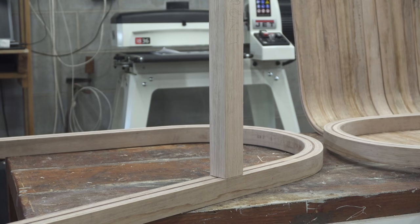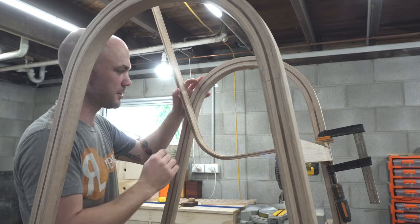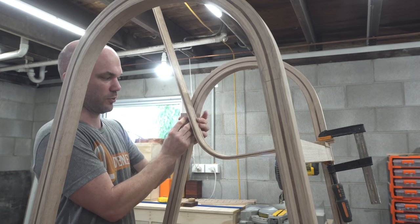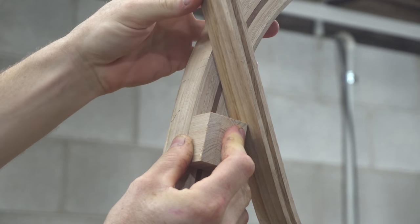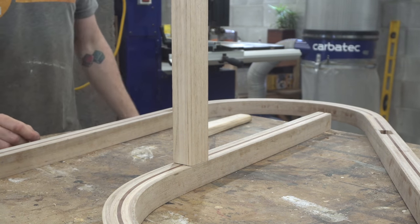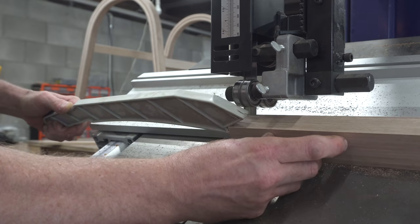I've set up the chair, and now with the front rail in place I can work out where the back rail is going to be for this slat. This curve is probably the trickiest bit about attaching the slats. My first thought was to cut an angle onto the rail and sit the slat against it, but then the tenon becomes a lot smaller and cutting the mortise is also quite tricky. So instead I'm going to attach the rail with a full mortise and tenon just below the slat, and between the rail and the slat I'll create a triangle piece to slot in — that's what the slat is going to sit against. I've worked out this angle is 31 degrees, so I'll do a couple of test cuts first and then make that triangle-shaped piece out of some Tasmanian oak.